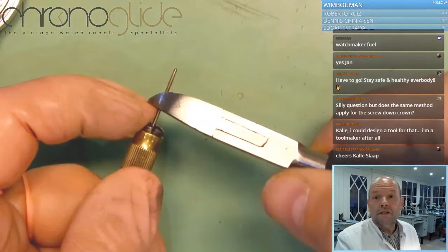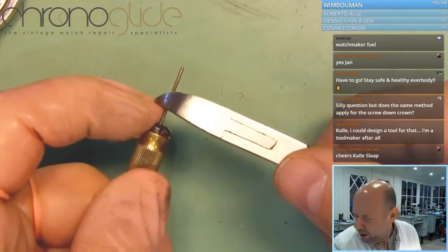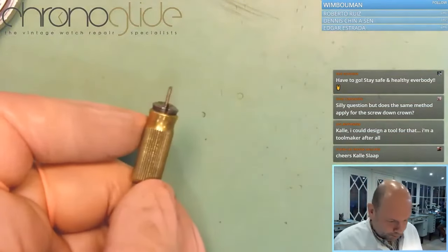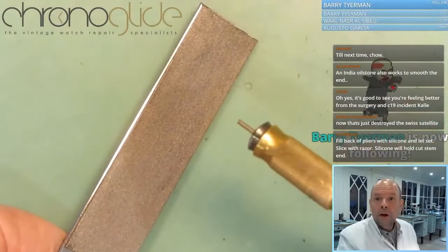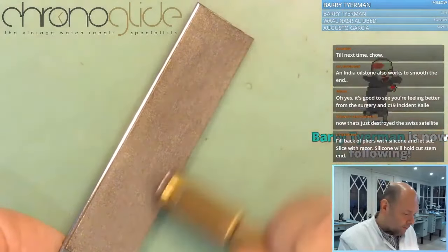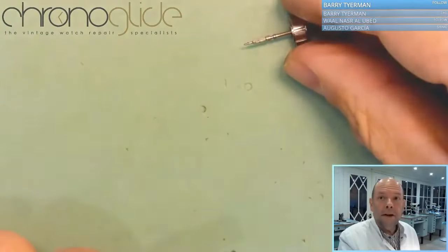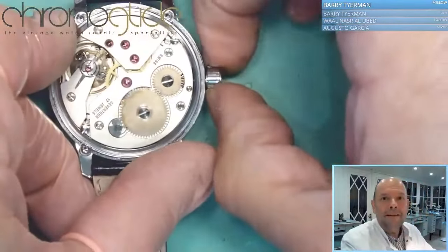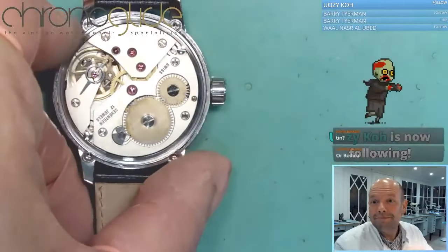I use this tool but there are others you can use — this is the one I like. Be careful with your eyes, always squint your eyes and look away because you don't know what's going to happen. Now you've just snapped off this bit of the winding stem. Twist it like this so you make it nice and round — you can see the double action: you are rolling and you are filing. Look at that — there's a crown and no air gap between the crown and the case. Simple as that.